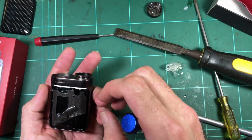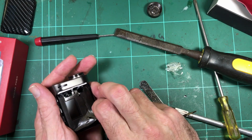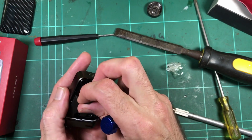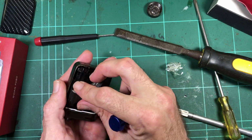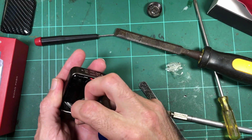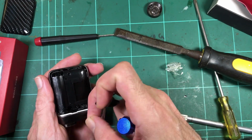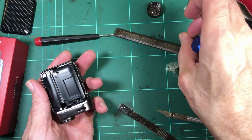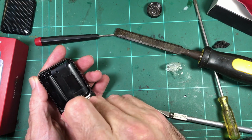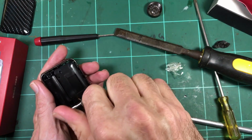I just take a device apart. Okay, let's see what made this one fail. What interesting thing? And then it's just full of juice. You're like, well, yeah, it's just juice again. So I must have done about 5 videos, and I didn't really post any, except for the Geek Vape Nova, which wasn't a liquid issue. It was just dead on arrival. Blown solder balls were all over the board, left over from the wave soldering or the reflow or whatever they do. But all the others were liquid damaged.